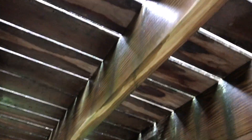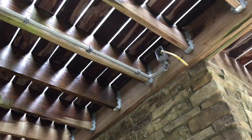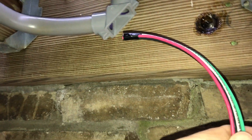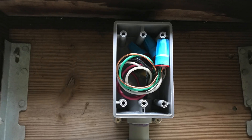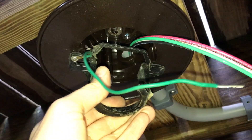I've marked my holes and pre-drilled because with screws as long as these, there's a risk of splitting the board without a pilot hole. The conduit is installed. Now it's time to feed the wire and complete the connections — some 12 gauge THWN, with no pull string or lubricant needed; no problems passing the wire through the conduit. I used exterior-rated wire nuts to complete the connections. The flange is installed and now we'll put in the fan bracket, with the long screws going through the box and into the wood blocking.